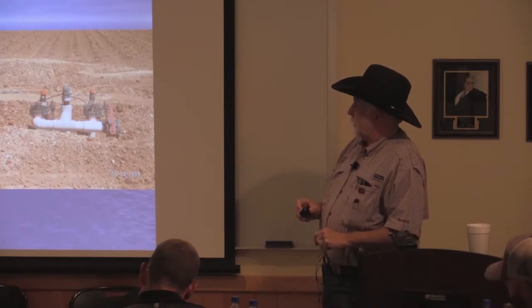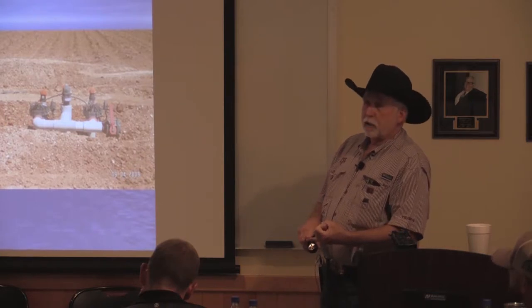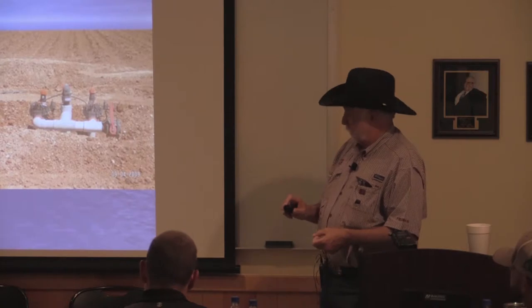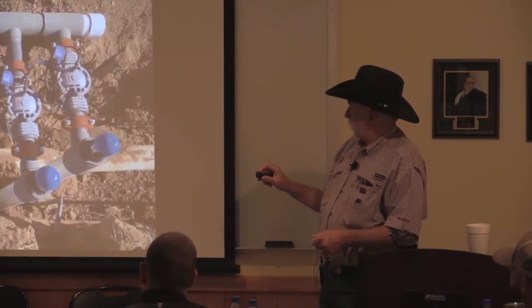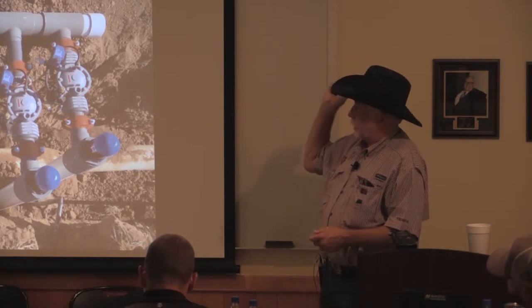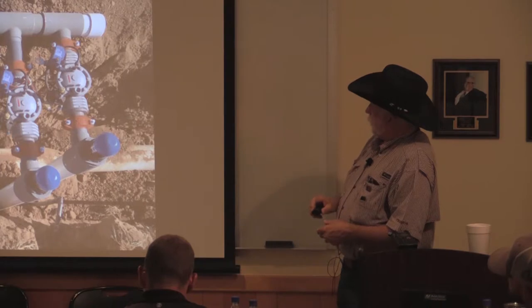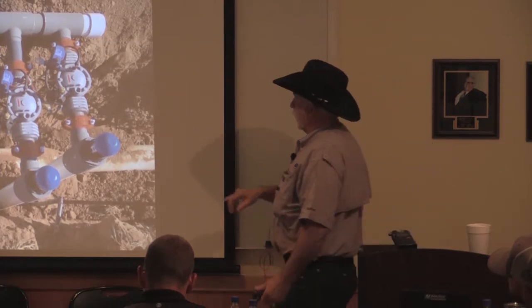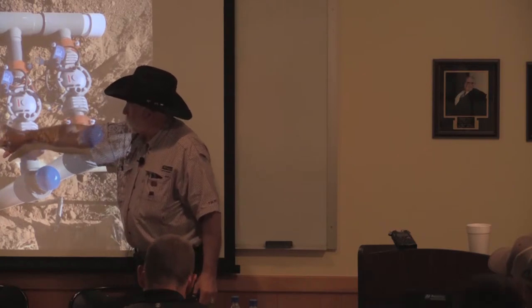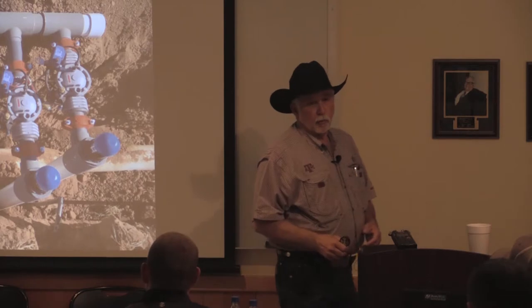And they're automatic. They can be either 24 volt AC where I run wires to them, or I can use DC latching. Here's one with the DC latching. In fact, that's out here. And the way these valves work, you've got a solenoid and a pressure regulator. And then on each zone, you can actually set different pressures if you want to.